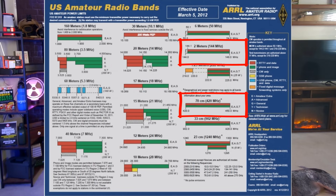The signal for CB isn't great for local because the wavelength is too long and it bounces around — it doesn't work very good for busy close local and flooding an area with signal. But it's also not quite long enough for skywave propagation. Here's a generalization: the longer the band, the better it's going to be at bouncing around, i.e. bouncing off the sky. Shorter bands, when you start getting into the two meter or 70 centimeter band, are better for local communications — flooding your immediate area with signal.